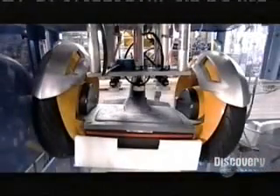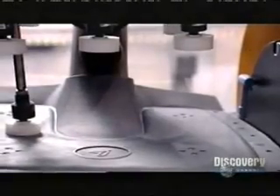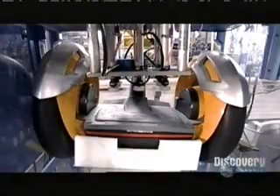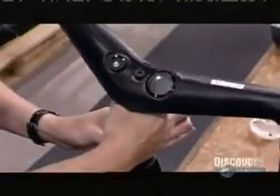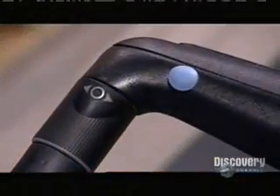This machine tests the rider detect buttons by applying pressure in a random pattern. The rider and cargo must weigh at least 99 pounds, but no more than 260 pounds. The machine also tests the wheels and motors. A handlebar on the control shaft lets you steer by turning the hand grip left or right. The motor responds by spinning one wheel faster than the other. You can also spin the wheels in opposite directions to make the vehicle pivot.